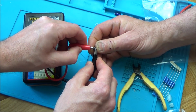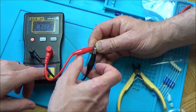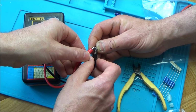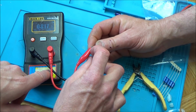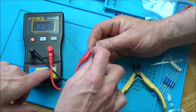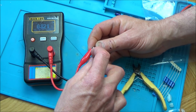So this is 63 volts at 4.7, well, this meter only goes up to 10 µF here, but 63 volts at 10 µF, it should be less than 2.4, and it's 0.8. So I think it might be shorting. Hold on. Yeah. There you go, 0.8. So at 22 µF it's 1.5, at 10 µF it's 2.4. So I suppose it's going up, so at 4.7 it would be roughly, what's the difference there, 1, so maybe 3 something, but it's well under, 0.8.